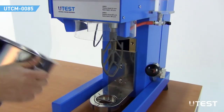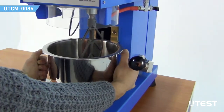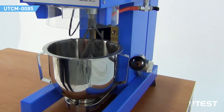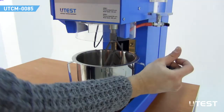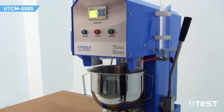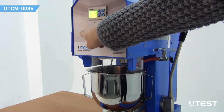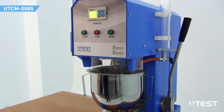Place the bowl to its seat, then turn it counter-clockwise until it is firmly locked into position. Lift the handle and open the valve of the water tube. After all the water is discharged, press the start button. The rest of the mixing process will be carried on automatically.